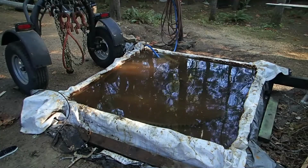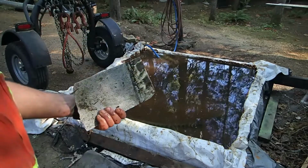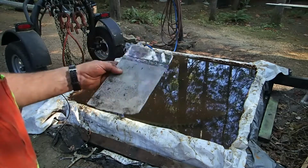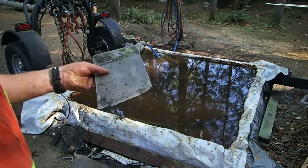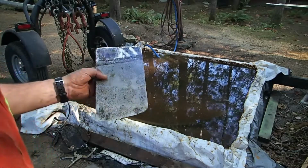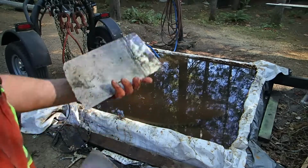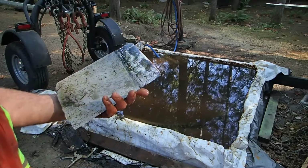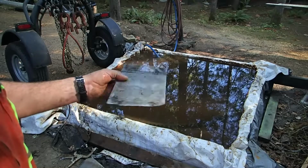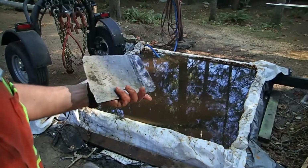So, thoughts on anodes. Surface area is good. It'll be tempting to use sheet metal because it's light and thin and easy to cut and whatever, but you are really trying to move this onto that, basically. And so you should look at anodes as something you want to lose the material. And so you need material to lose. So putting thin stuff on, this is 1/16, and it lasted one go.